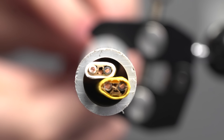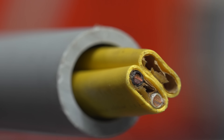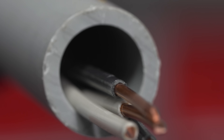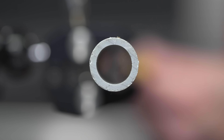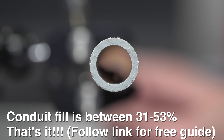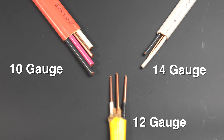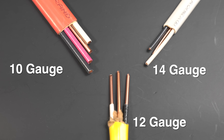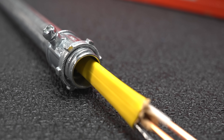But there's an even bigger problem I didn't talk about, something called conduit fill. Conduit fill refers to the amount of wires you can fit inside of a pipe. This doesn't sound like rocket science — you might think you just keep sticking wires in until the pipe fills up, but that isn't how it works. The rules vary a bit depending on the type of wire you're using, but at maximum you can only have 53% of the pipe filled. And unfortunately, that Romex is seen as a single conductor even though there are three wires inside. So even a single piece of Romex inside this half-inch conduit will quickly exceed that 53% fill.